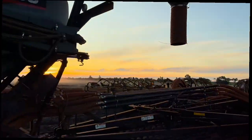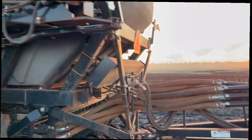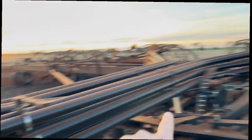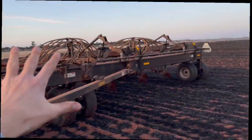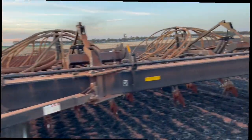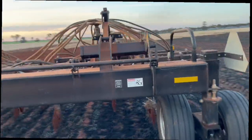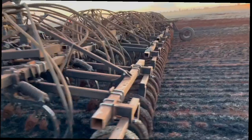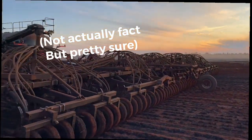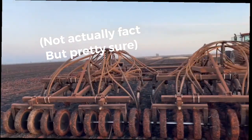The conveyor is awesome — would never go back to an auger. You don't have to empty out a hopper, so what's not good about that? There's a hose run back there. I had to do a little bit of patchwork just to get us through to the end of the season — it's a bit rough. The folding bar on this machine is a complicated 10-step procedure and you've got to get out a couple of times, but once it's folded out it's very good. So 80 feet — this is actually the first factory 80-foot bar in Australia, made in Canada. There were other 80-footers before this one but they were 70s extended, so that's a bit of a fact for you.